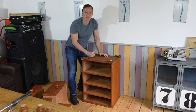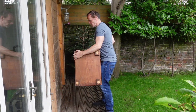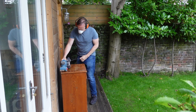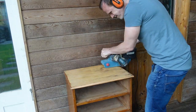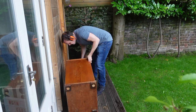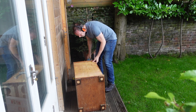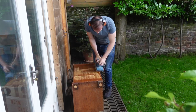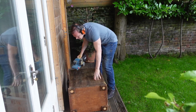I'm going to take it outside and give it a good sand down. I'm going to sand this down using a belt sander as it will be much quicker. I'm making sure I'm using an old medium grade sandpaper, as I don't want to take too much off — the belt sander can be quite harsh and rip through the wood really quickly. I'm making sure I'm sanding with the grain. The sandpaper is 120 grit. Now to do the side — I'm going with the grain, except near the top and the bottom I just have to turn the sander sideways. It's taking out all the dents and the little nicks. I'm going to briefly sand the back, but it won't be seen anyway.